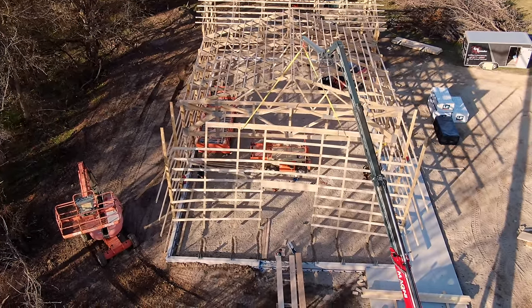Check it out, guys. This thing is finally starting to come together. We've got our last wall section done. So right here, this was kind of a crazy wall. Not typical spacing. We don't even have a consistent header height over here because we've got that huge shed dormer that's gonna go across this entire front. So way up here, this is where it's gonna change heights. And that big 2x12 header up there is where the dormer is going to go out.